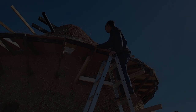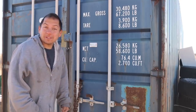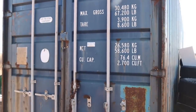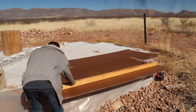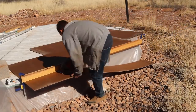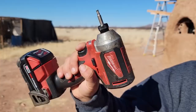I think we might have it! We're ready for the next phase for the eaves. I'm going to pull out those boards and start cutting the strips. I'm glad I put them in the shipping container because we ended up getting a little sprinkle of rain out here — keeps them dry. I brought these panels over to the top of our root cellar, the biggest, flattest space I could think of to get this done. I'm looking to cut eight-foot-long strips. I just clamped a 2x4 to the sheet to give me a straight edge for the cut — that worked out really nice. I should be able to cut these fairly quickly with that method. Now I'm loaded up with some ammo and my weapon of choice, and we're going to string some boards all up along the outside of the eaves.